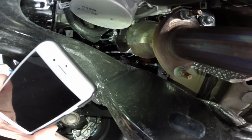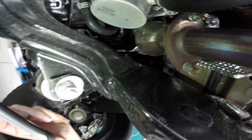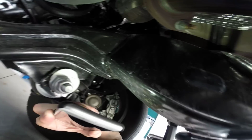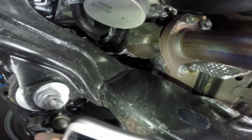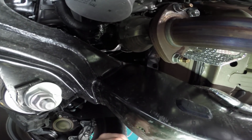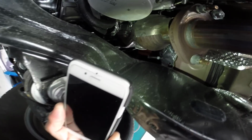Okay, so this is looking up at the outlet from underneath the truck. Now I'm looking at my frame here. Luckily, I'm not seeing any rust on the welds yet. But I did see some pictures of it very clearly developing on some other guys' trucks. So basically all you're doing is attaching the heater hose to that and then routing it down, zip tying it to the frame so its exit point is below the frame line, so you won't have condensation dripping on your frame constantly.